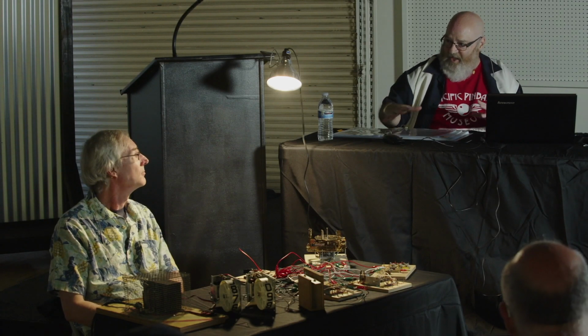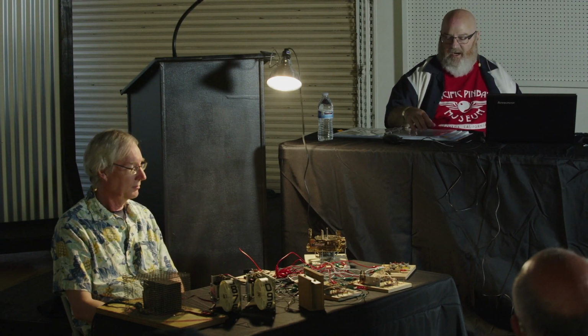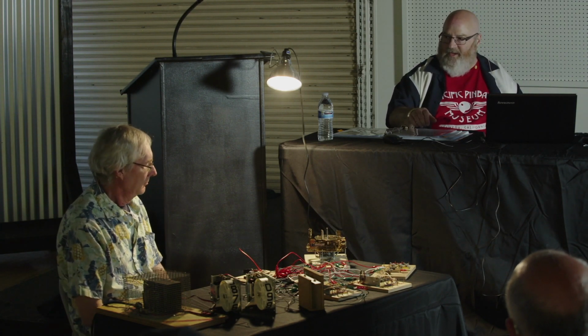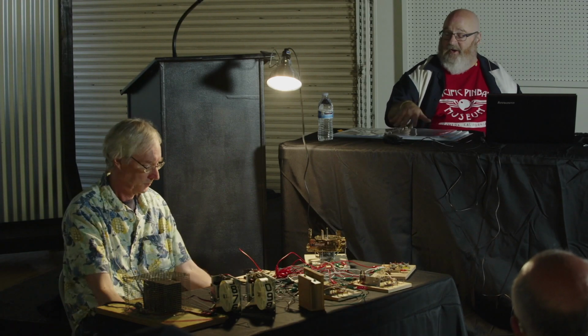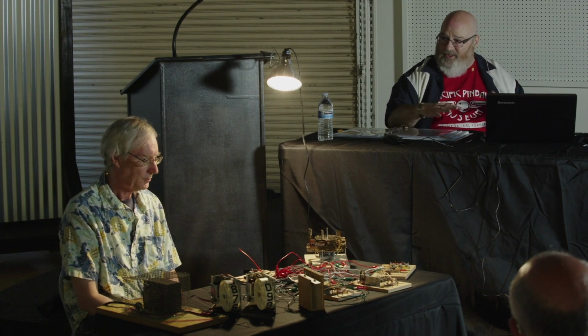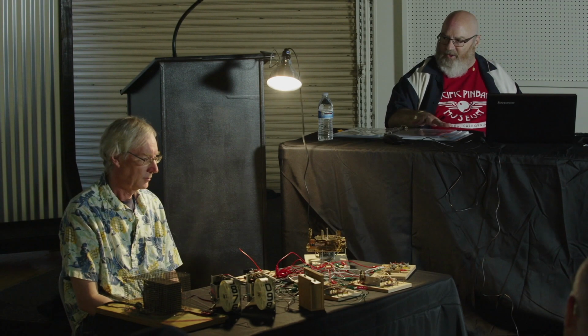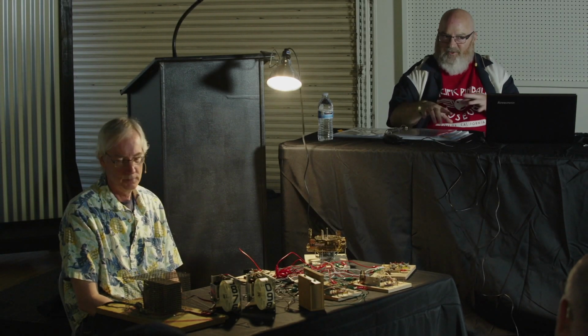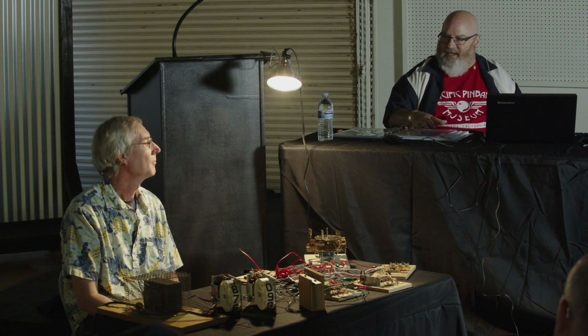If you want to study this and you're familiar with schematics, take a look at the circuit for a quarter that can give you 2, 3, 4, 5, or 6 games. I think they do 6 on some. It's a very complicated use of a variety of different motor switches. And in fact, I think in that situation, they actually use all 5 pulses, but count those pulses against other motor switches that will be open if you're only supposed to get so many credits for that quarter. So it can be a complicated circuit where it's actually using the 5 pulses but blocking a bunch of them.